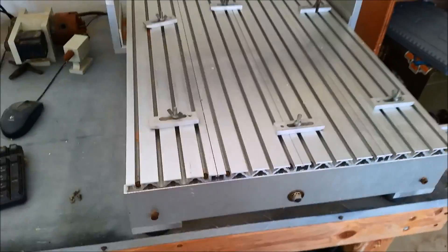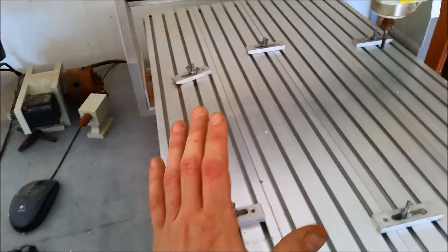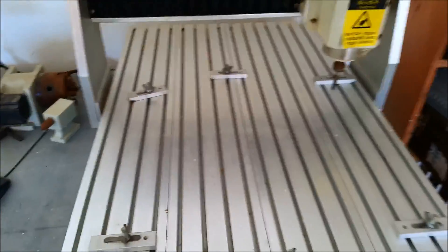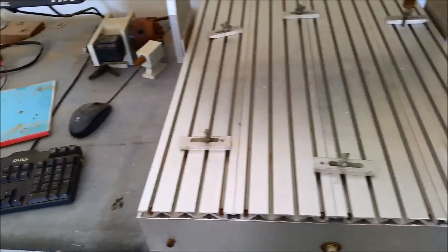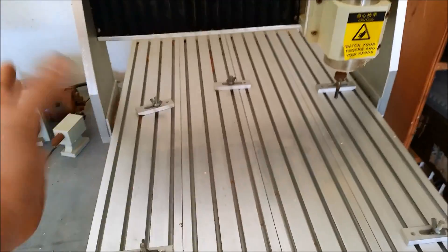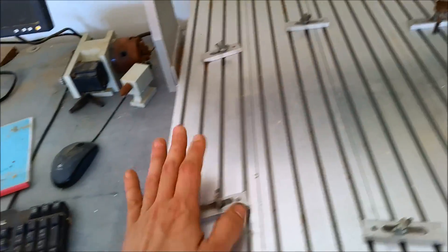That's not necessarily a bad thing if you're just doing a one-off shot or don't plan on turning the machine off. But it becomes a huge problem when you try to actually mass produce anything, because inevitably the machine is going to turn off. If you have a jig set up to drop in pieces, have it run and cut, pull pieces out, and drop in new ones, the problem is that if the machine gets shut off, you've got to rehome everything and run through several test cuts. If you had limit switches, you could just tell it to go home, find it, and be done. I have some limit switches from my 3D printer — extras I bought in case those broke — and I'm going to install them on here in the hopes of getting this thing to home on its own.